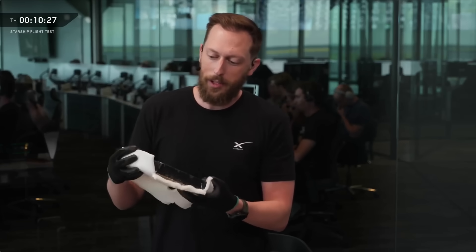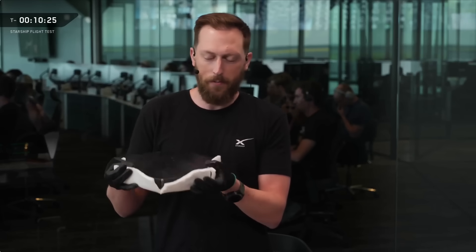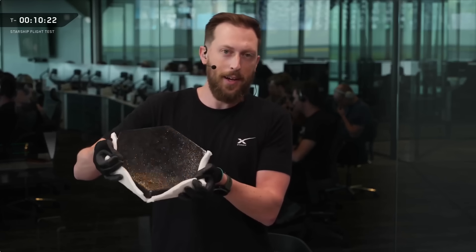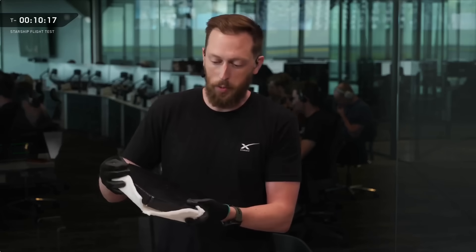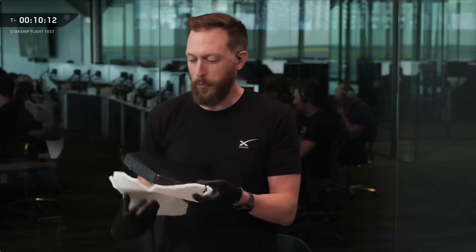To help fix that, we have the crunchwrap. We take essentially what's called Vulcan felt and wrap it around, so as the tiles sit next to each other, there's a small bit in between that helps offset that heating. It's just one of the ways we're continuing to iterate on this heat shield, getting towards rapid reusability. Pretty much the entire vehicle has those crunchwrap tiles on it today — we've done this on multiple Starships previously, but this time the whole vehicle has it, which is special for today.